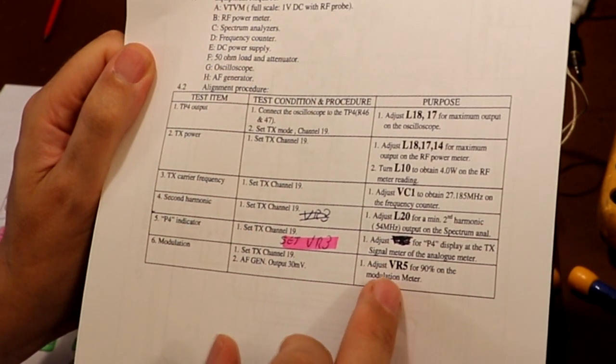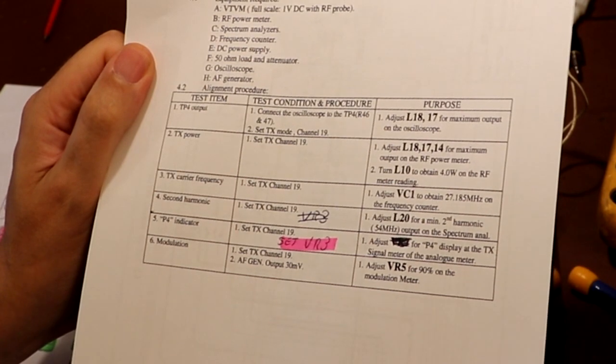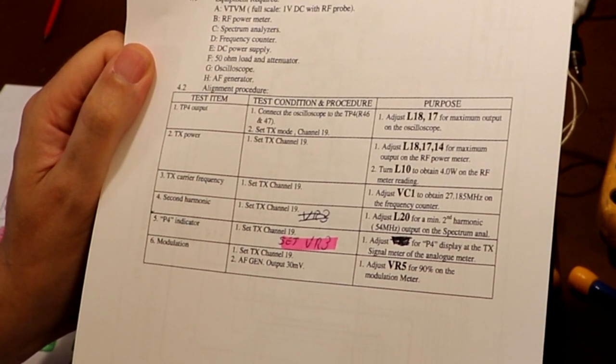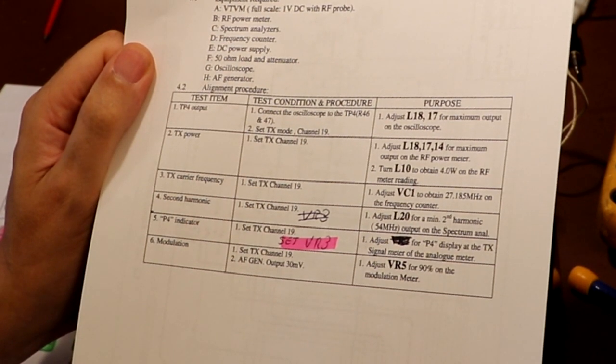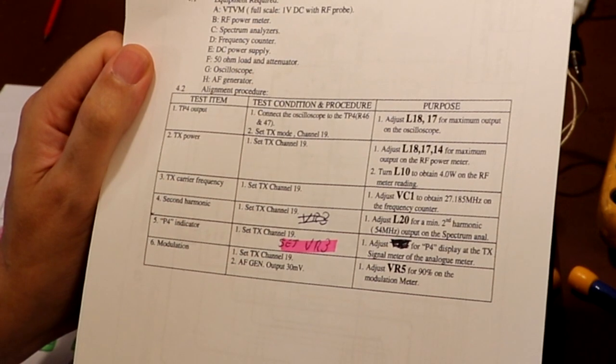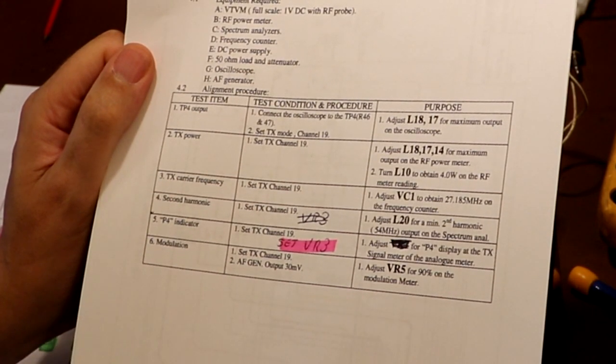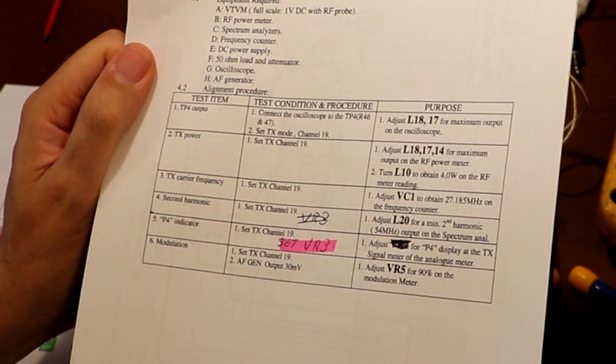And not only that, I can hear some resonance within the radio. It's difficult to describe. I can hear it straining. I can hear something which must be some kind of over modulation effect. So I'm going to show you that, and I don't necessarily completely trust the modulation meter on the analyzer, so we'll also have a look at it on the scope.